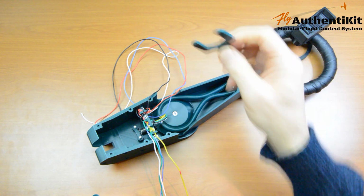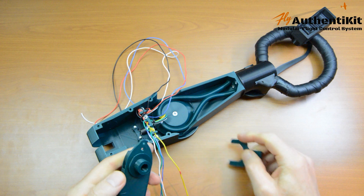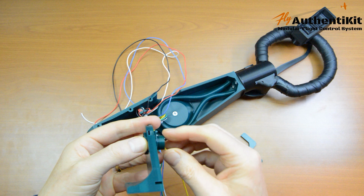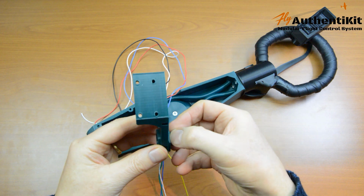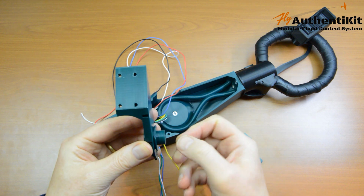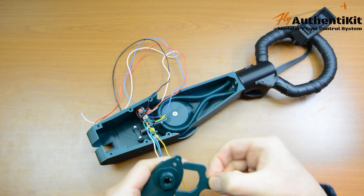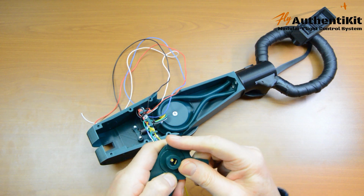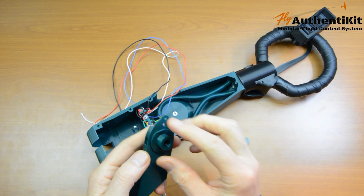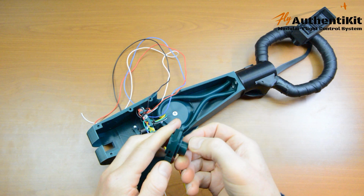There's a little tool which I've built for you that will help get that tightened in tightly. Now when it is in, it should be really quite snug there. There shouldn't be any of the thread showing. In fact, there's a good way of showing it. You can see there's no gap, or barely any gap, between that flattened side and the base. If you're not getting that, then try to screw it in here. And if you're having some trouble, maybe even get a wrench on it. Just gently push past any of the stoppage, because you need that to go in quite easily later on.